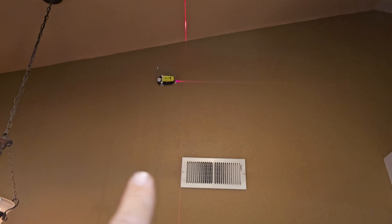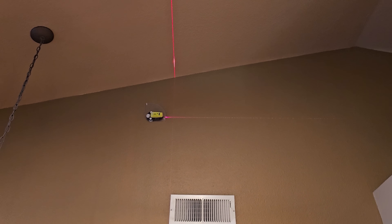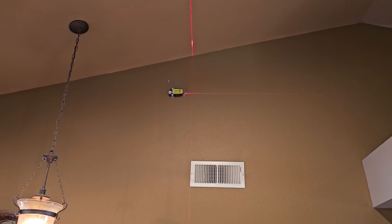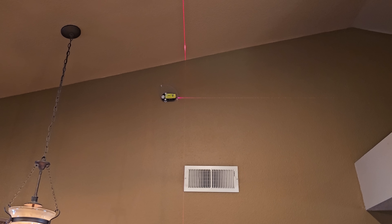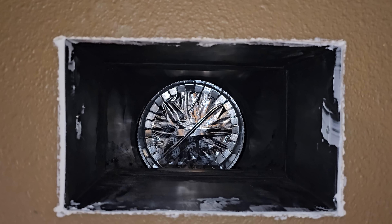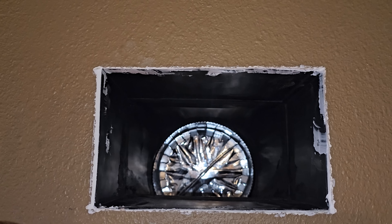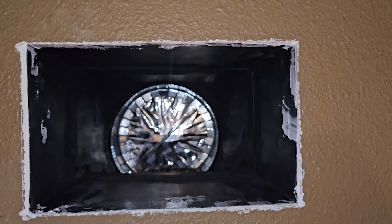I got it marked out — putting it at about 23 inches from the top of this boot, we're going to level it. The whole point is to hit the ceiling as much as possible, let it travel along the ceiling, and probably try to angle it toward the window a little bit for mixing. It's a six-by-ten boot so it'll be a little bit shorter. Got the boot installed, painted on the inside, got four screws on this one, and a cap so dust doesn't get in. It logically makes sense to always caulk around the boot — you don't want air to hit the backside of the register and escape into the attic.